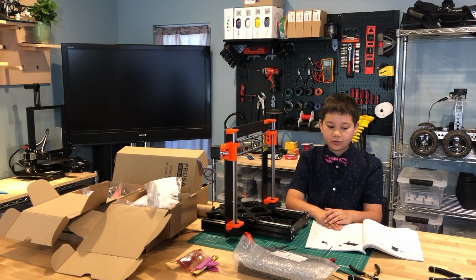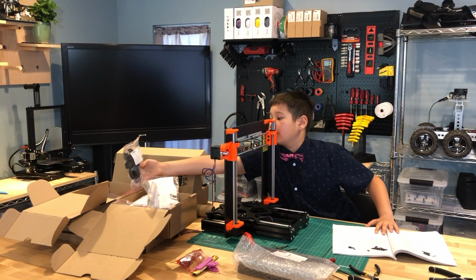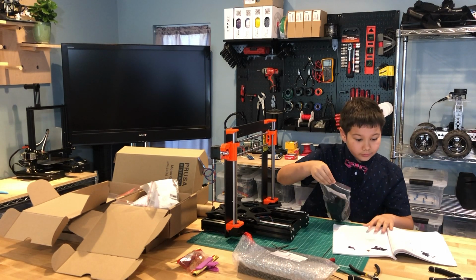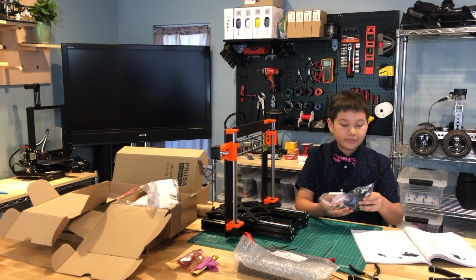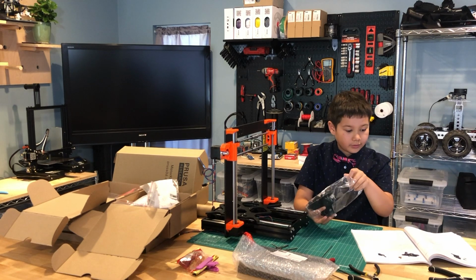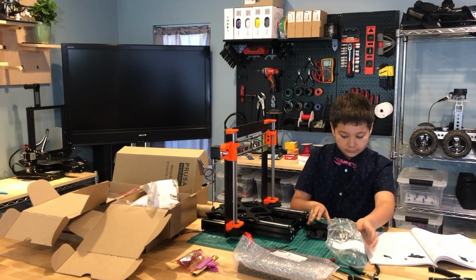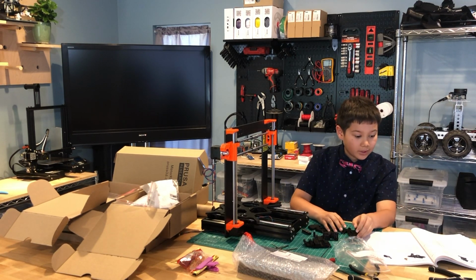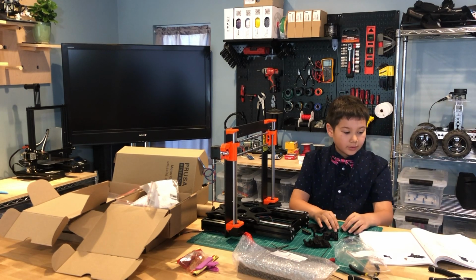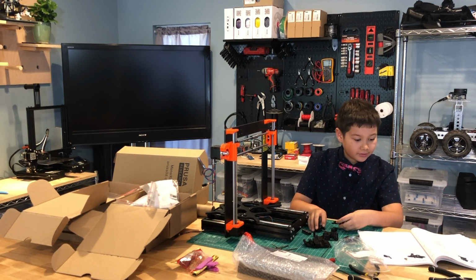So, the first step is to prepare the extruder parts. We need one extruder body, which is in the 3 printed parts bag here. We also need an adapter printer, one FS lever, and we need an M3x18 screw, an M3x10 screw, an M3n nut, a steel ball, a 10x6x2 magnet, and a 20x6x2 magnet.